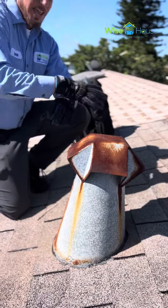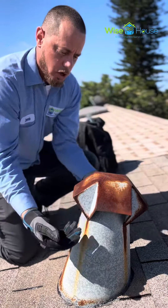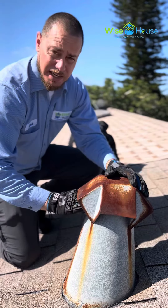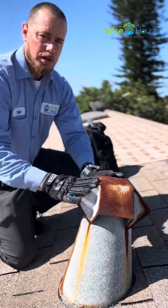This is a mushroom cap, and it's infamous for rats jumping in here and getting right into the attic. Underneath these corners, underneath these openings on this mushroom cap, it's just wide open — a rat can get in here easily, drop right into the attic, and then you have an infestation of rats. We're going to close off the hole that's inside here so the rats can't get in anymore.